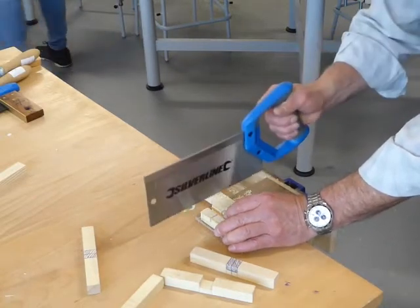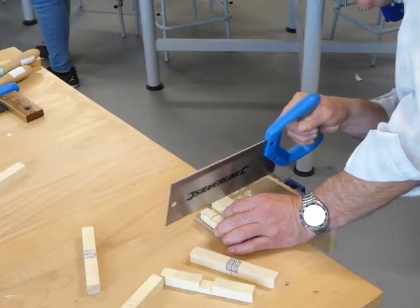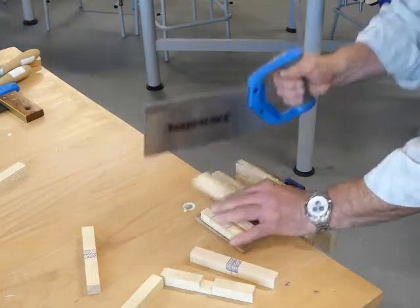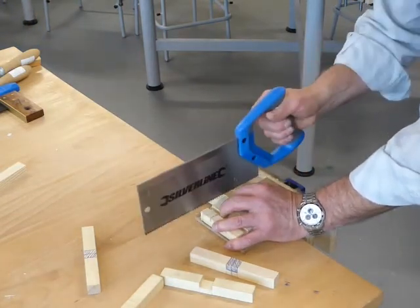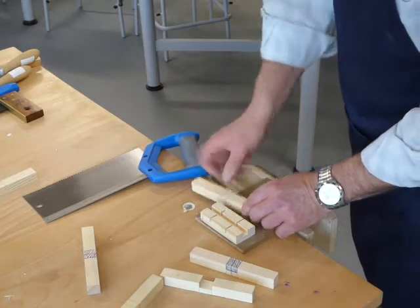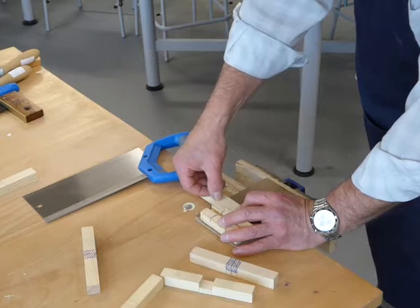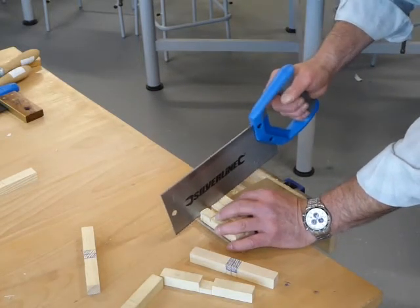It's easier because it's pine. It's easier if you just bring the blade towards you. Now keep checking both sides, to know where to stop. I turn my piece of wood to the other side until I match the line to the side of the bench hook. Again, I start at an angle.